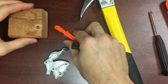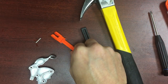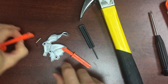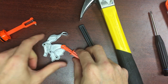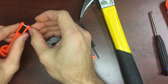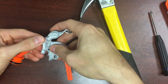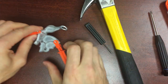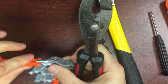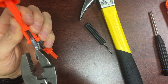We no longer need this hammer, so set it aside. The spring guide goes there and the plunger rod goes up here — on the nose, kind of looks like a rabbit. We're going to drop the pin knurling side up. We're going to take our pliers, and if you have adjustable pliers, I like to adjust them to the wider setting, and just press the pin in until the knurled side is flush.